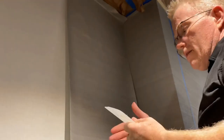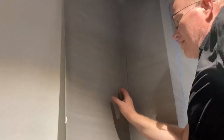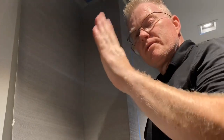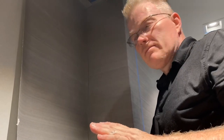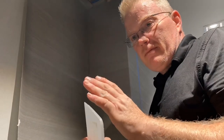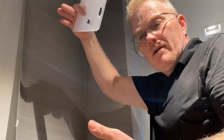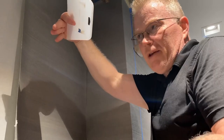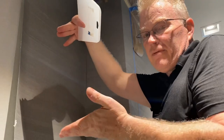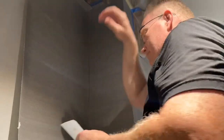Now remember the anomaly that comes from hanging grass. Remember the zigzag effect of the blinds, right? So if your wall is doing a lot of this, your grass cloth only has so much give. The longer the piece, yeah, you can make this move down here, but if you need this whole thing to move, it's not happening. Okay?